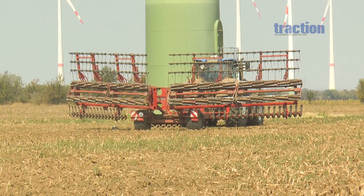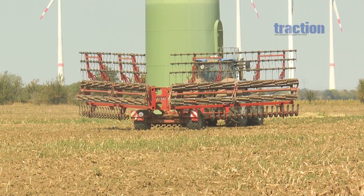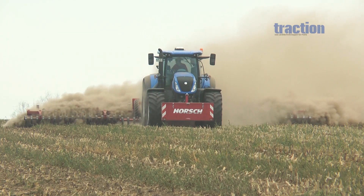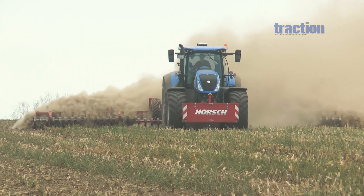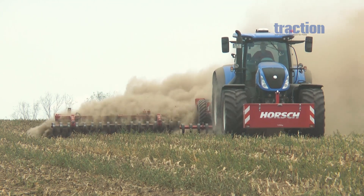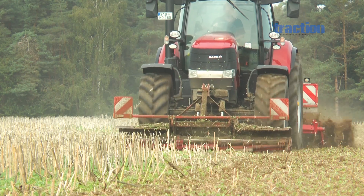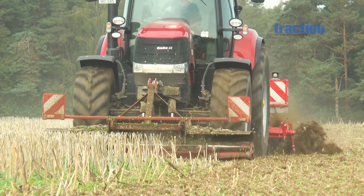The Contro 12 TC frame is split into two separate wings, each housing a tandem of two rollers. This means ground contour following across the direction of travel is actually restricted to 6.1 meters — that is the working width of each wing.